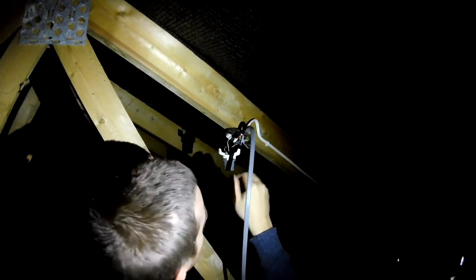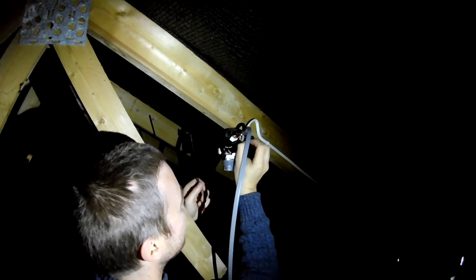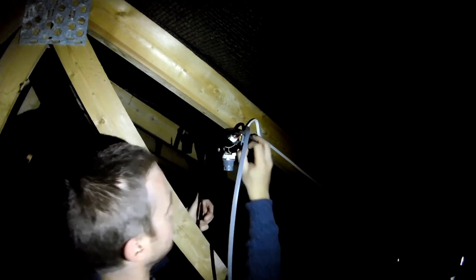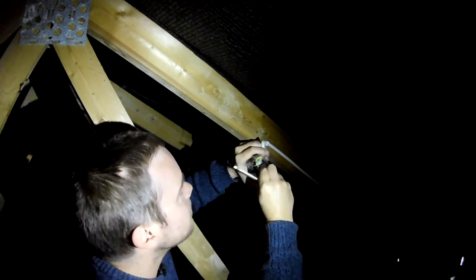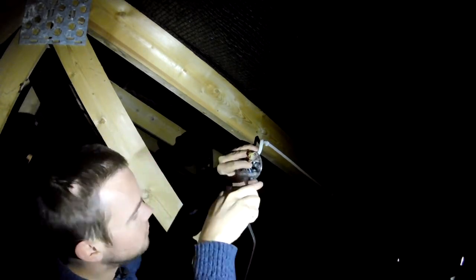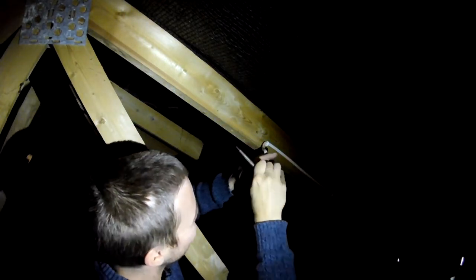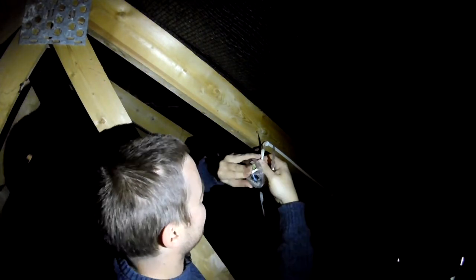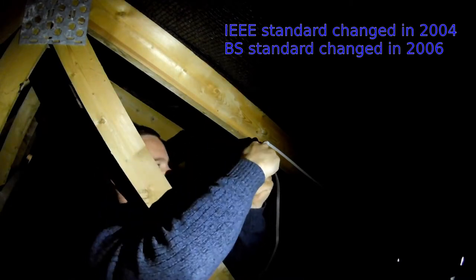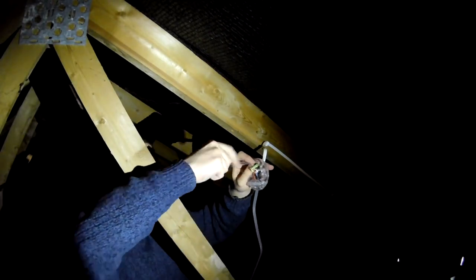Now I'm going to change my mind. It's too difficult getting two wires into each connector, so I'm going to pull this light housing off and put the other one on instead — one of my new ones — because as previously mentioned they've got extra space for conductors. Here's the replacement. I'll wire this one up before I attach it to the wall just to make things a bit easier. It wasn't all that long ago that the standard changed from black and red to blue and brown — I think it was 2004 — so I can't criticise them too much for these being the old standards. Working with solid core is hard work though, just so inflexible.